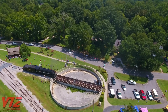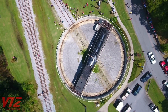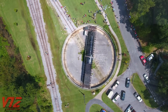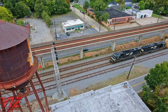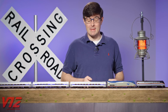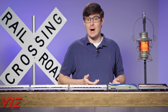You've probably seen railroads turn locomotives before on turntables — like this one in Somerville, Georgia. These were common in the days of steam to get engines to face forward. These days, freight locomotives are often run back-to-back, meaning a forward-facing operator's cab is available no matter which way the lash-up is pointed. But what if you need an entire train turned around — maybe a passenger train only set up to run in one direction? That's where a Y comes in.